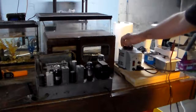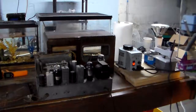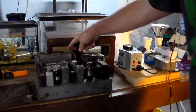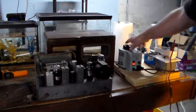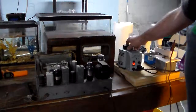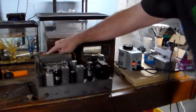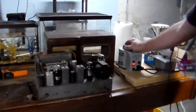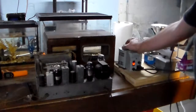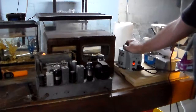I want to see it. I'm going to turn the Variac on. Let me turn that back on. We'll start off here and bring up some power. And you'll probably see some light bulbs light up, these two guys here, as I start to bring up power, or who knows what you'll hear. So we're still coming up. Not enough yet. The light bulbs are just starting to come on. I don't know if you can catch that one there yet. This little voltage monitor I have here is still too low to see anything. Just hoping I don't hear like a loud pop or a spark.